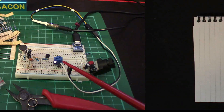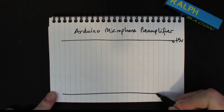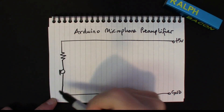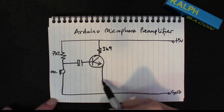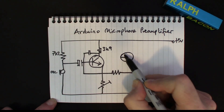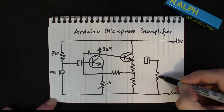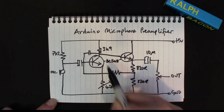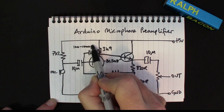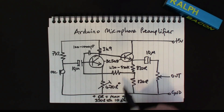We'll talk about this in more detail and I'll show you the circuit diagram. So this is the microphone pre-amplifier. Let's draw our power rails first — plus five volts — there's power to our electret microphone that goes into the base of the transistor, with a little bypass capacitor. A second-stage transistor output, a 10k variable, splits the potential so we get some bias. That capacitor determines the frequency response and that resistor determines the gain.